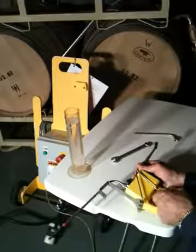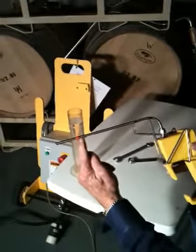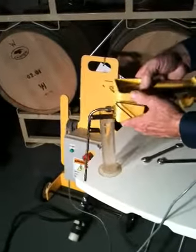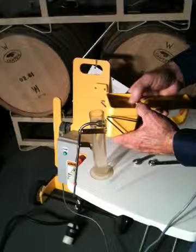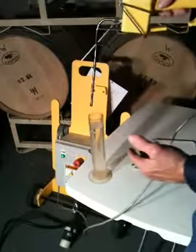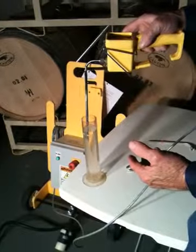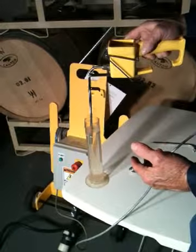There it is. So now we have a new, longer sensor tube, but it still cuts off approximately 2 inches from the tip. So let's, first of all, see where the calibration is. We'll hit start. So now the pump will be running. You've got this sticking down in the barrel. When the level reaches the red band, it should cut off. There it is.